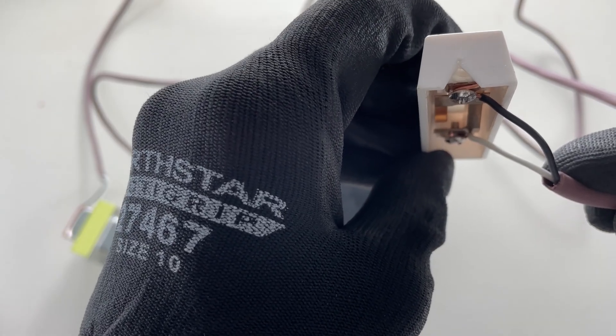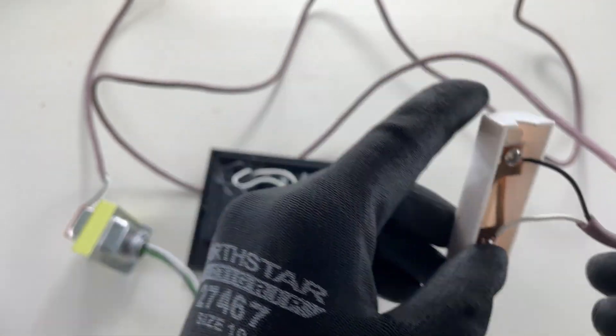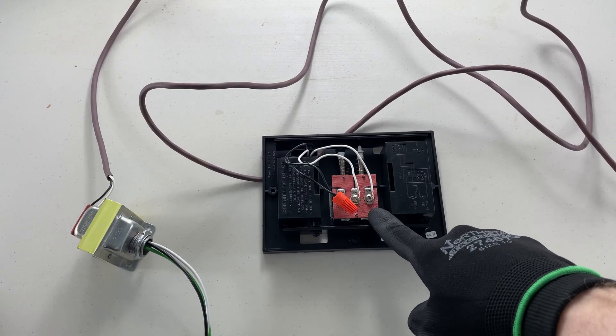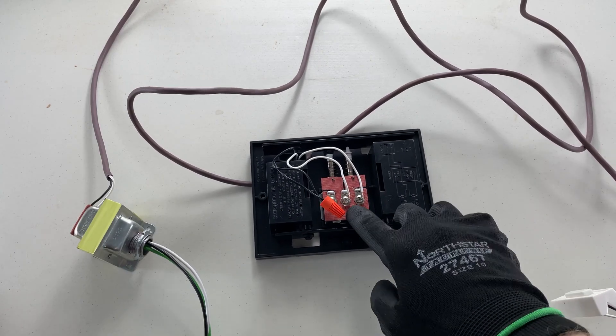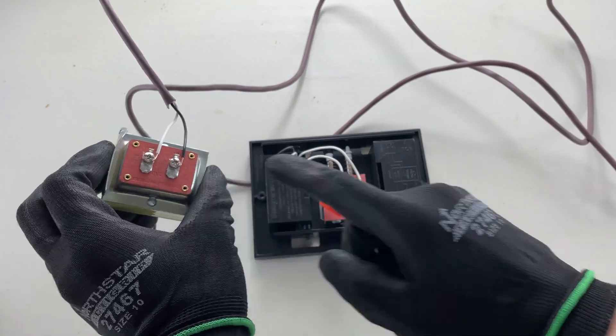This thing is super simple — all it does is connect the two wires together. You can picture it coming back on the white, back inside our chime, which is going to ding on the front door, and then returning on the white on the transformer termination spot, which completes the loop back at our transformer.